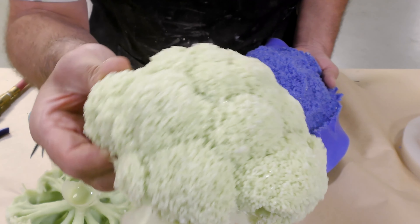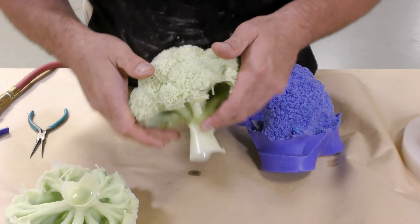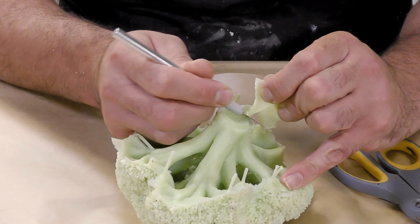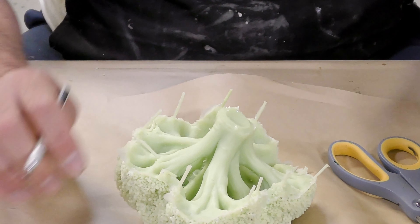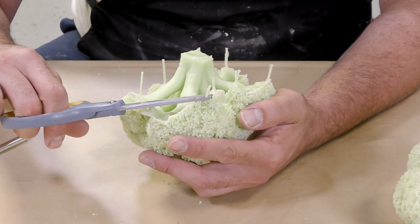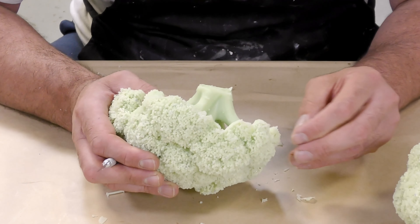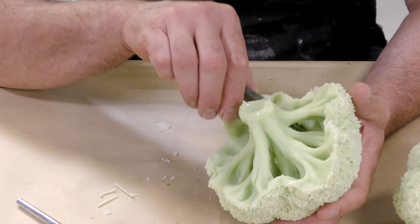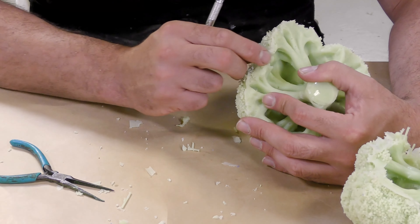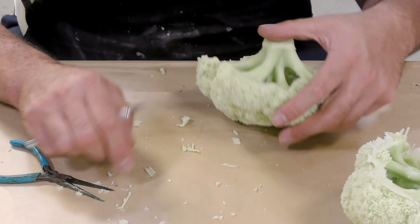To prevent fine detail of the broccoli head from ripping out of the mold during demolding, use compressed air to facilitate an easier demold with a much better success rate than simply pulling the mold apart. Use pliers to pull some of the fine details out of the mold. Here's the final result — the mold captured all the detail and the casting material reproduced that detail faithfully. To finalize the piece, trim away extra material: the air vents are trimmed with scissors, and the flashing along the mold parting line is removed from around the perimeter.